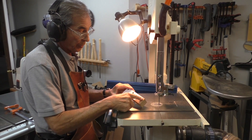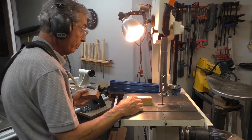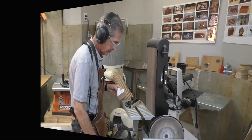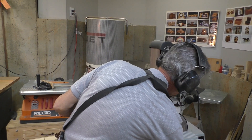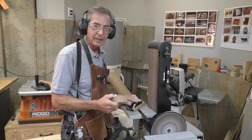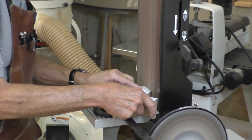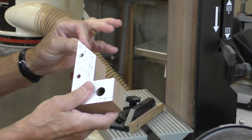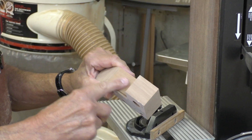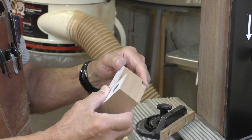Now I'm going to cut the 45-degree angle but leave some distance because I'm going to use the belt sander to smooth it out. I've got the miter gauge set at 45 degrees. Now I'll slide this in. Got it sanded pretty smooth right to the line, and I'll use a piece of sandpaper on a block a little later to get rid of the bandsaw tooth marks.